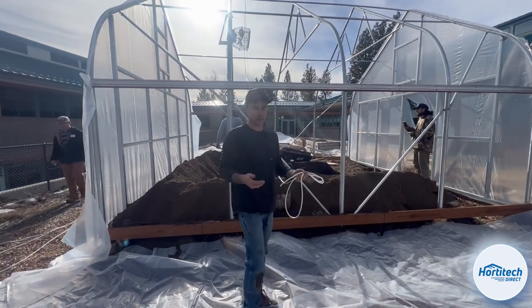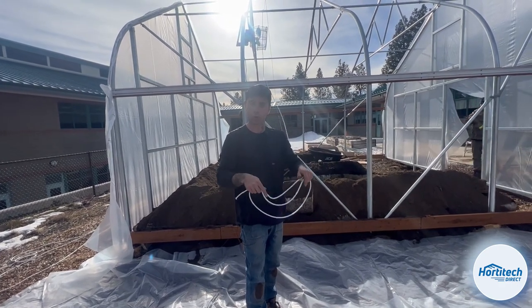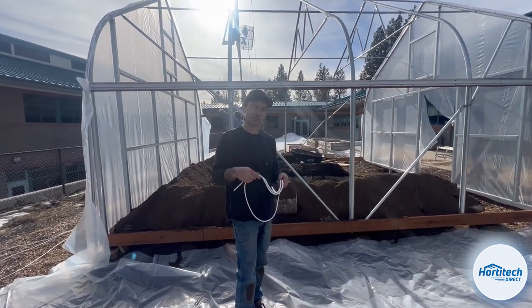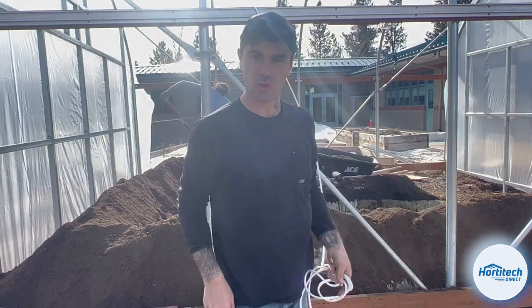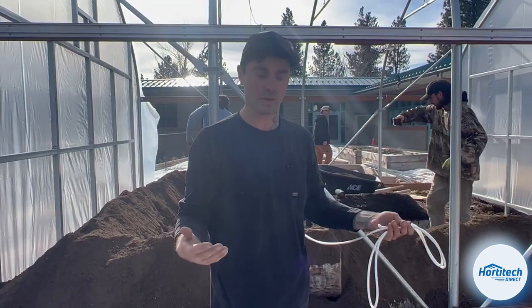And we're going to actually sacrifice that whole leading edge of the plastic when we pull it over, because the strength of this tensioning on that plastic is going to cause that whole edge to wrinkle. So you're going to want to think about that ahead of time when you're pulling your plastic over your structure using this technique, because you're going to damage some plastic. So when you get it over the structure, you're going to see us pull a good amount past the bottom till that wrinkle is completely gone and there's none of that stretch mark over there.